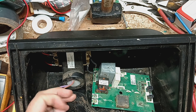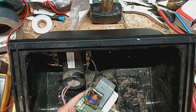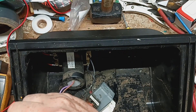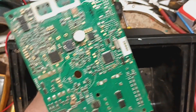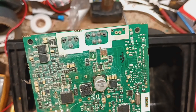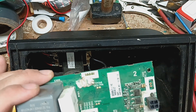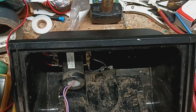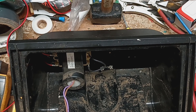So there's the capacitor. I don't know what size it is, but we'll put a tester across there and see what we read. Then we'll ohm the primary side of the transformer to make sure it's reading what it should be. I don't know what the secondary side is supposed to read because that's not universal — the primary sides are fairly universal. But yeah, I mean there's burnt stuff there, there's corrosion up here, part of a trace missing there — it's pretty toasty on there. Now they do have a conformal coating on here, which I'm sure protected and kept some of the parts from messing up. You can see pieces broken off or rusted — whatever happened, happened.